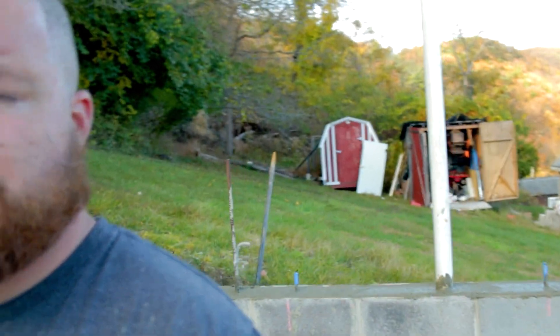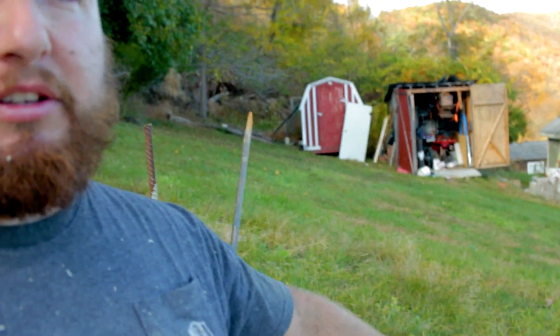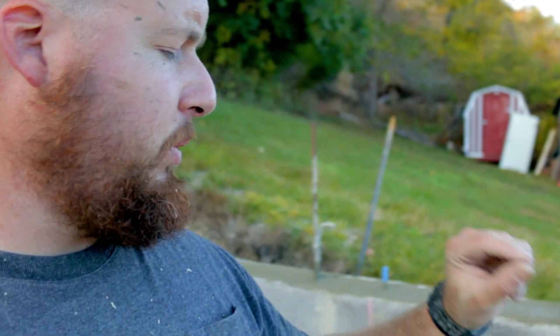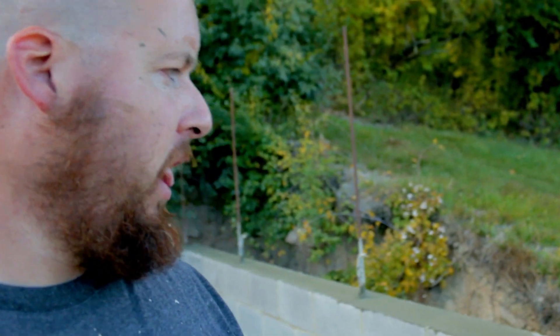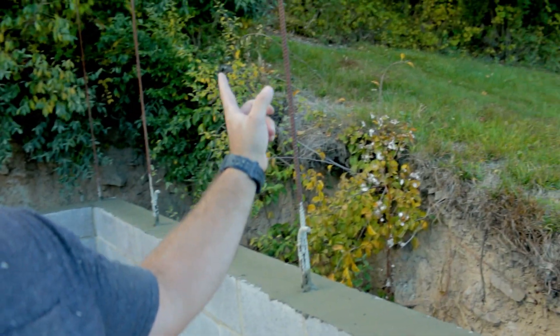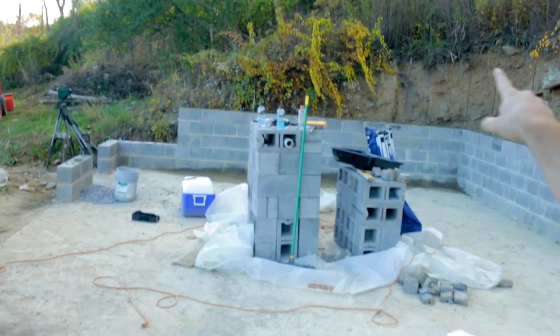We're done with this side. We did have a vent over here — right there — that just got poured solid through the bond beam. We tried to make this as level as we could because we're going to be putting down a sill plate on this. We paid a little more attention to our detail, made sure it was nice and smooth, went over it twice. We will be putting a sill gasket on there to fill in any imperfections, but we want it as close as possible — we don't want that board to bow and wave. On this side is our joint where we're going to come up another three courses and then step it back, because as you can see we have our dirt on either side — that's just why we had to step everything back. It was just easier than building it fully up.